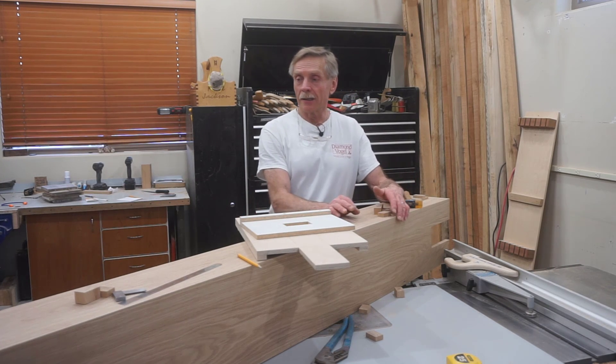After flush trimming using this template as a guide, I have a perfectly sized tenon — both shoulders are square to each other because of the template. That small discrepancy in the glue-up is too big to leave for the finished joint between the beams. I added a strip of thick Nashua duct tape to each side of the top corner of the other beam so the template fits snug and centered, then clamped it in place and routed in the same fashion. To clean up the small discrepancy in the shoulder I use a template with a perfectly square edge, placed flush to the shoulder so I can trim the side of the beam flush — with the same sharp router bit it just takes a few seconds.